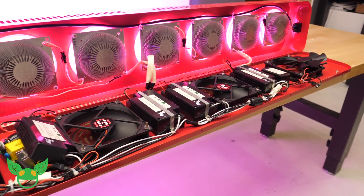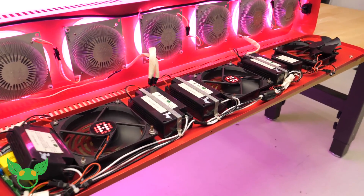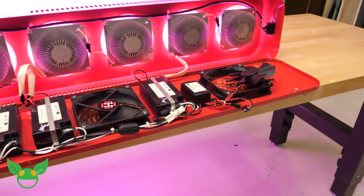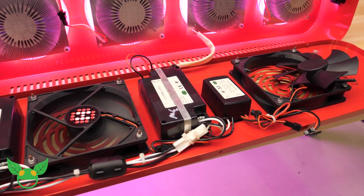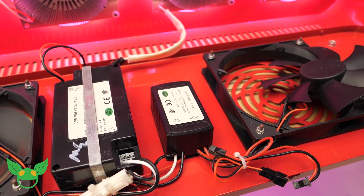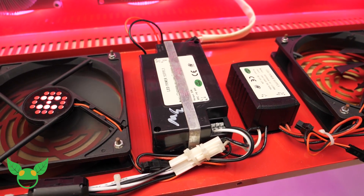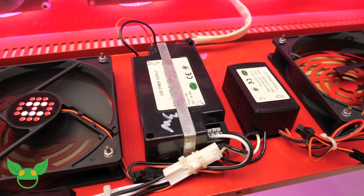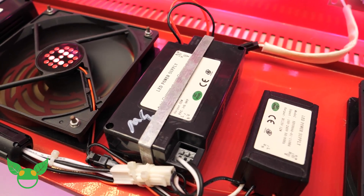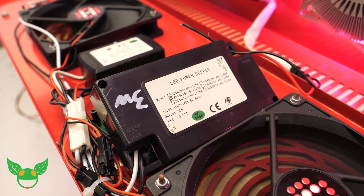Most of the time you're gonna open up one of these fixtures — and yes, opening it up is gonna be required. There may be a void-warranty sticker, but if you're looking to hack your fixture, you may not be that concerned about ripping it. You're gonna notice a lot of components in these import LEDs. Typically they're gonna have a big transformer-looking thing and a small one. The small ones are typically your fan drivers — usually 12 volt, though this one happens to be 15 volt. The larger boxes are the drivers for the LEDs.